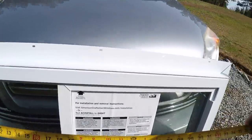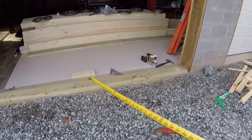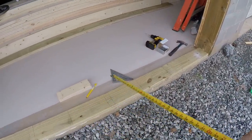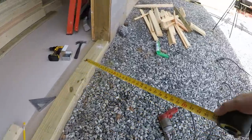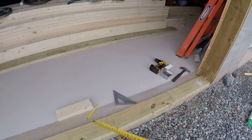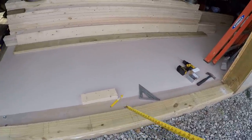I'm going to just check the RO of the window. I know it's three foot, but I'm going to double check. It's three foot. I've got to figure this out now because I marked them right here and that's wrong - the window's going to be too far to the left. This is where I get mixed up. I'm off, so I've got to redo this. These are made for 16 on center - that's what the problem is.